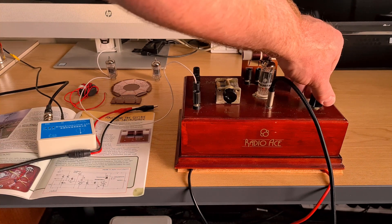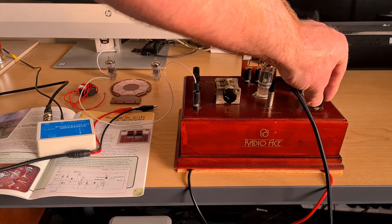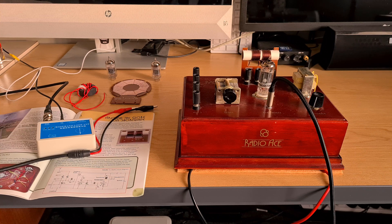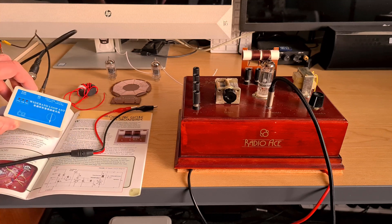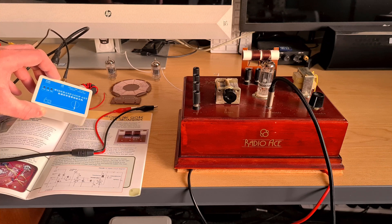Note that it hasn't turned it right off — you see the valve is still there. I've turned it down to lower the plate voltage right to close to zero. Taking off that long wire antenna just at the moment — conditions aren't fully dark yet, the sun has set in this part of the globe. In addition to the long wire, we also have an amplified loop antenna. I've found the combination of the amplified loop and the 12BH7 to be absolutely game-changing and unbeatable.